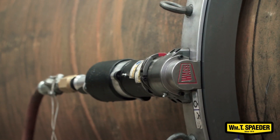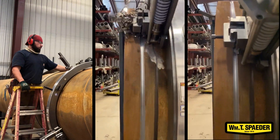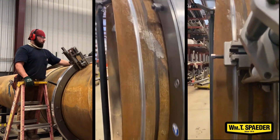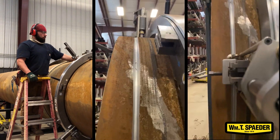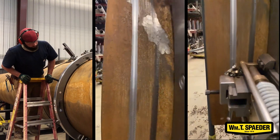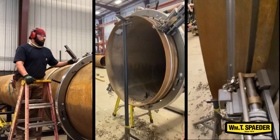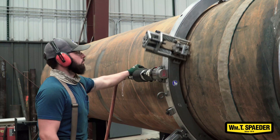The machine has a hard bit blade that will take off a couple thousandths of material every time it passes around. Following behind it on the exact opposite end of the pipe is the beveling blade, if you need a beveled edge, and it does the same thing and creates a chamfer around each edge.